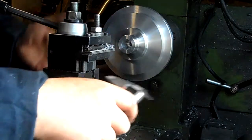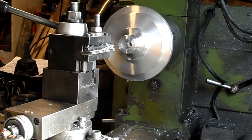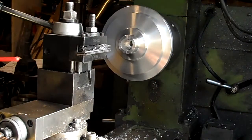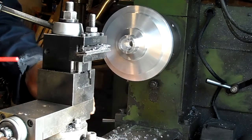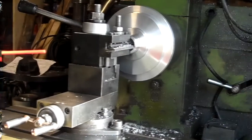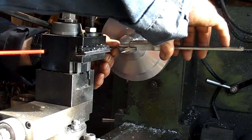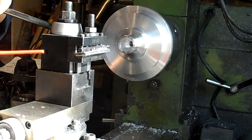Taking out about a millimetre at a time — that's half a millimetre aside — so we're up to about 26, 26 and a quarter. With the deflection on the tool post and tool, and the slack gibs on my carriage, it tends to cut on the forward and the reverse, so you've got to watch that you don't go over size by pulling the tool. That's clearing to be 26.3 — close enough. It's not a critical one that side, just a wee clearance.